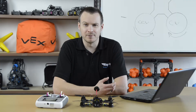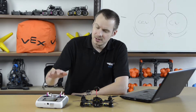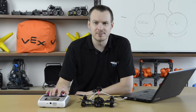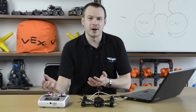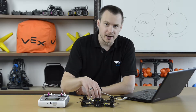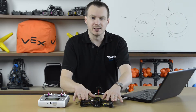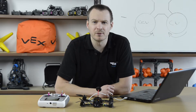We've looked at how the motors and propellers influence the way the drone moves, but there are two other really important parts of the jigsaw: the transmitter and the flight controller, which is mounted on your drone. The transmitter is the device the pilot uses to control the drone. When you move the joysticks or change one of the switches, it sends a signal to the receiver on the drone. The drone then works out how it needs to change the speed and power to each of the motors to make the drone move in the way the pilot has requested — this part is done by the flight controller.